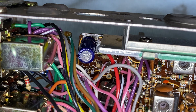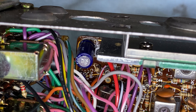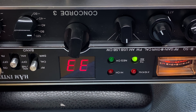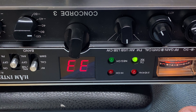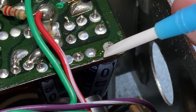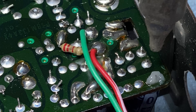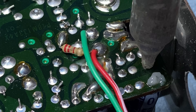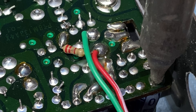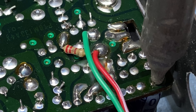Let's have a look at the capacitor in the corner like we normally do — yes, that looks like it's been leaking its juices. It doesn't look too bad but it's definitely leaked, so we'll change and repair that. On the initial power up it's not really doing a lot, so we've definitely got a bad trace. Looking at the solder joint where the capacitor for the AVR is, the solder has actually started to crumble away — must be some chemical reaction with the stuff that's in the capacitor and the solder. I put some flux on it and tried to desolder it with the solder gun but it just was not melting at all no matter how much I tried.